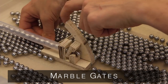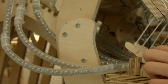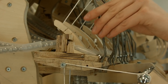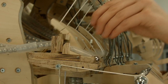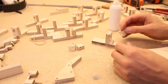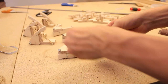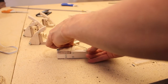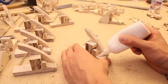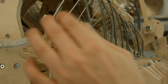The function of the marble gates is to stop the queues of the marbles and distribute one marble to the charge position, like so. I redesigned this system six or seven times in the summer. I rebuilt this whole thing with the lifting fingers because I just didn't find a good enough solution. This was in the end something that worked, because you only want one marble here and you want to stop the queue.